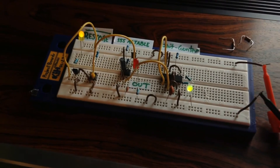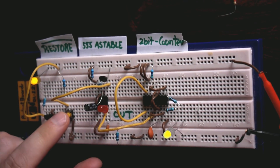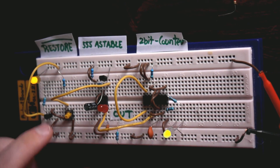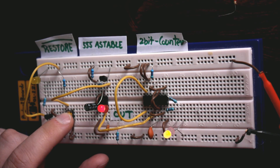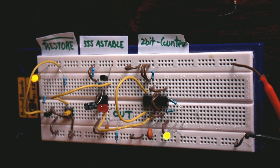So what's wrong? You can also ask why does it happen when it goes to green again. You must remember, now we have only one LED changing at a time — there — and now another one — there. And now two LEDs are changing at the same time. So that will give you a hint that this circuit needs decoupling.